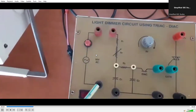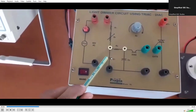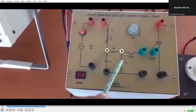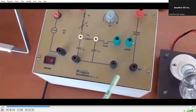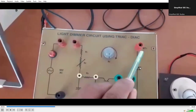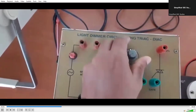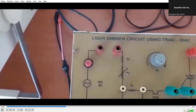There is a fuse which supports protecting the device against overcurrent. We have the main supply, and the terminals: capacitor C1, C2, R2, R1. These are the different terminals which you can observe here. We have the DIAC combination — DIAC is applied to TRIAC. For the gating and triggering purpose, we connect the DIAC combination. We have the terminals of TRIAC, MT1 and MT2, and this particular knob is used to vary the firing angle.